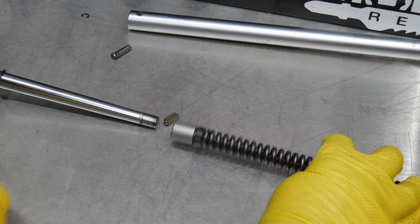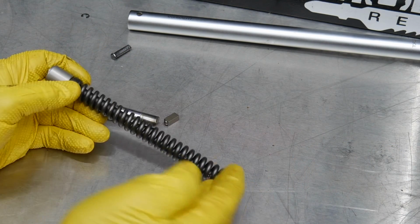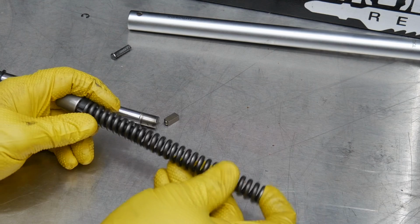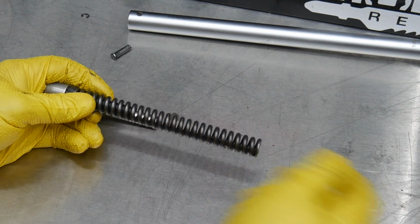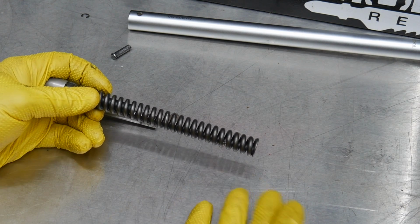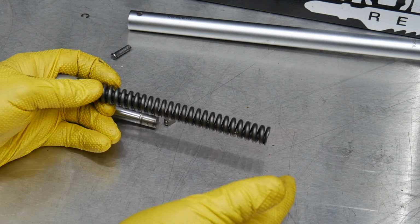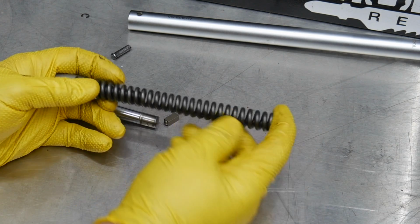That also explains why it's very important to return your torque wrench back to the lowest setting, because this spring will fatigue, especially if you keep it compressed or if you stretch it. So, car springs, coil springs in a car, struts in a car, valve springs, over time they degrade, over time they weaken. Same thing with a torque wrench.